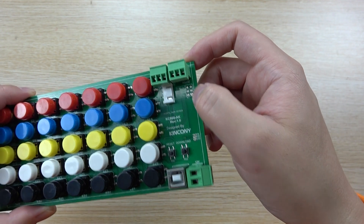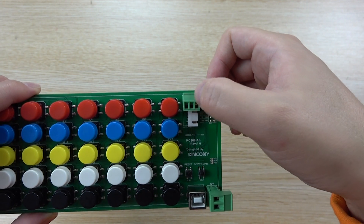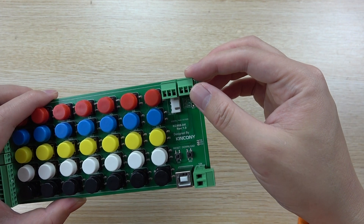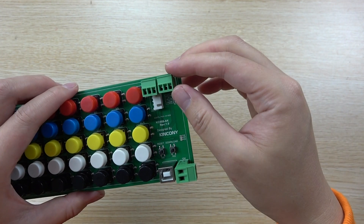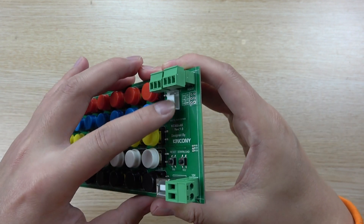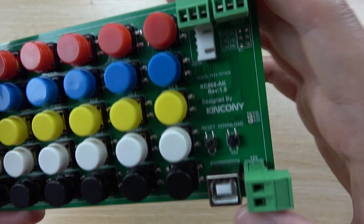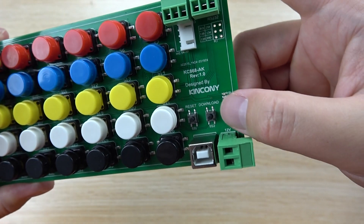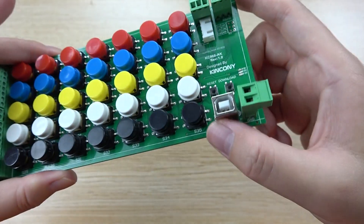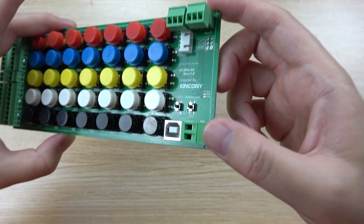You can see some free GPIOs. There is an RS-232 and an RS-485 interface. You can connect with your relay controller via RS-232, or for devices like the H32B Pro, you can use RS-485. There is also an I2C extension connector. You can see the reset button and USB port for downloading firmware, and the power supply input is DC 12V.